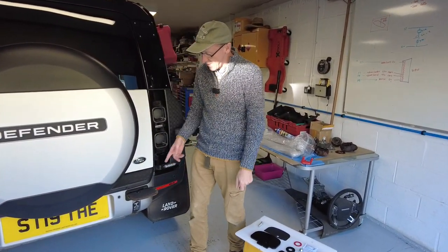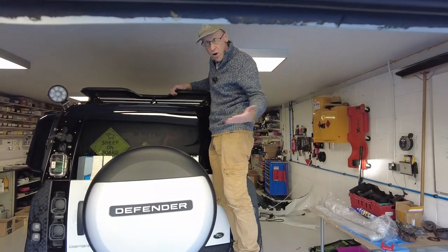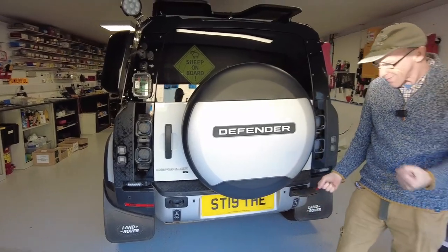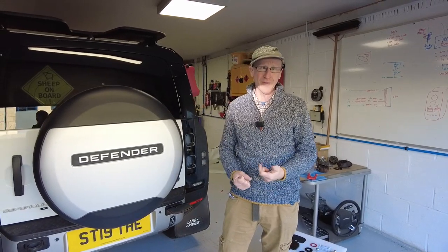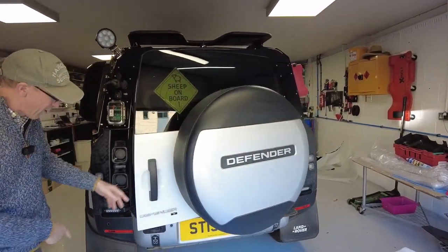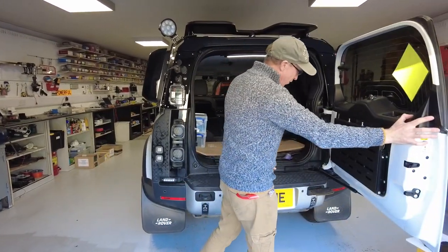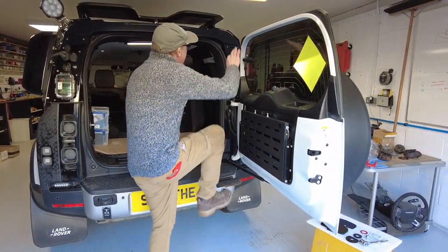The idea of this is to give you an extra step up so you can get up onto your roof and do stuff. It's not a full ladder - it doesn't give you full access - but it does give you that extra bit. If you've got the loops, you've already got another loop fitted, so if you need to tow someone out, towing on two loops will spread the load. Each hoop is rated to 10 tons. We felt fitting it on this side was inconvenient because all Defenders, whether left hand drive or right hand drive, hinge on that side and you'd be knocking into it. On this side it's never going to get in your way.